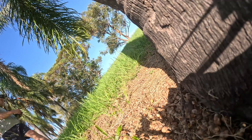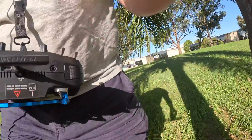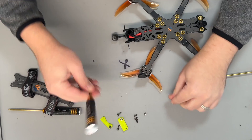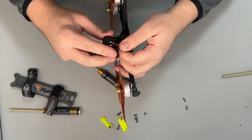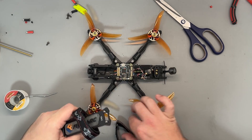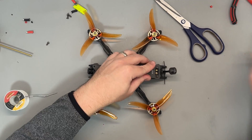On my first flight with the Volador V2, I crashed, and it appeared that my flight controller was dead. After taking it home, I found that I hadn't actually pushed the plug between the flight controller and the ESC in all the way, and in the crash the plug came loose so the flight controller wasn't getting any power. When fixing this, I also discovered another change — the XT60 plug is now reversible, so you don't have to have a twist in your battery leads, and you can now align the battery plug with the battery pads on the ESC for a nice clean build. With all of that fixed and the connector swapped over, I took the Volador V2 out for another flight.